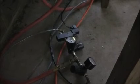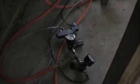Got a couple regulators here. One's for the blow up rubber thing in the candy bowl. And then so you get 2 different pressures. Run the cooler at 60 psi. And the inflatable rubber candy scare is running at full pressure, 100 psi. And the power supply is in the box for the solenoid, 24 volt for that solenoid, and then this is the power supply that runs the drill motor. Can control the speed by changing the voltage.